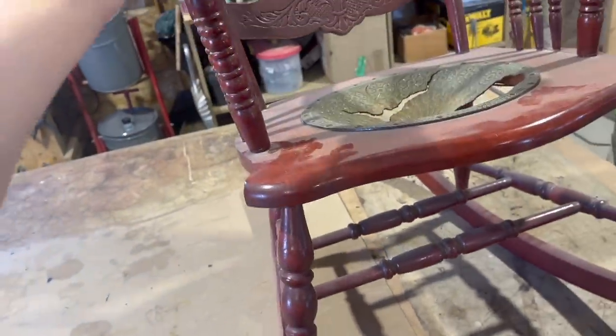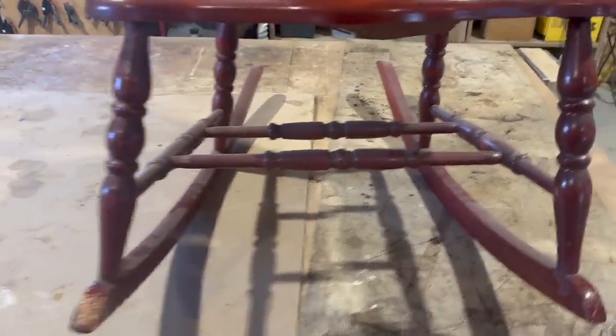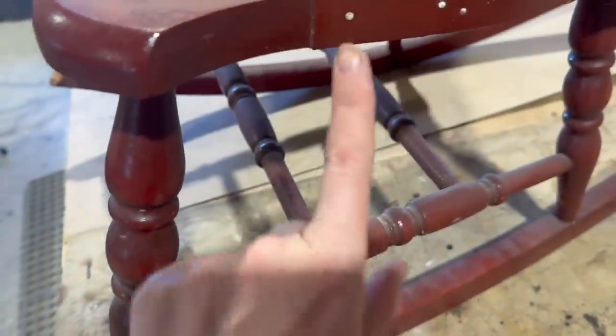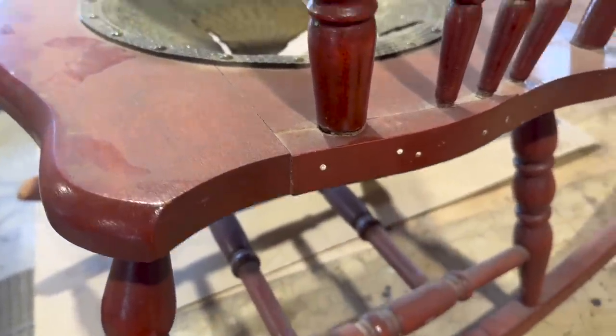We've got a little bit of a contribution from a cute dog, who chewed up one of the rockers, and all of the joints are really rickety. So a complete re-glue, of course. And there are some nails sticking out in weird places. Some additions, I think. Here, there are some nails, as well as up here, we've got a nail sticking right through the seat, ouch. And we've got an entire side that's kind of broken off and a few nails added here for the repair. So we're gonna take that all off and do a proper repair.